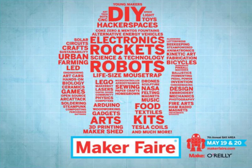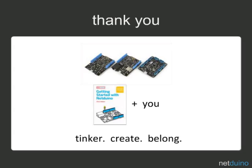Right. If you want to play video, for instance, you'd end up making a display component which stored the video locally to pipe it directly to the display. Much like Blu-ray players might have a dedicated stream between the actual Blu-ray decoder and the HDMI port interface that's inside those. Anytime you get to the big displays, parallel interfaces, you're really amping up either the number of pins or the speed of the megahertz, or you're creating dedicated buses for them.